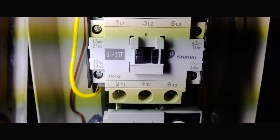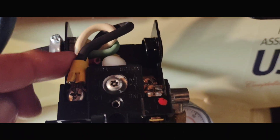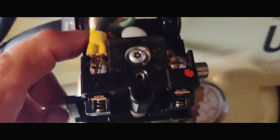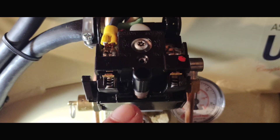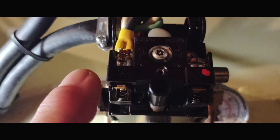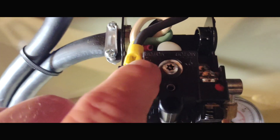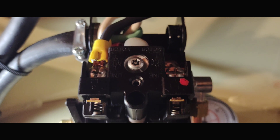Getting to the switch itself, there are actually two contacts side by side - one here and one down below. If you're just replacing the switch after burning your contactors up, you might want to find the good side. Either side does the same thing - as long as it makes contact you'll be good. Or you could run one wire from one side to the other, having it solid, so you're guaranteed a connection.